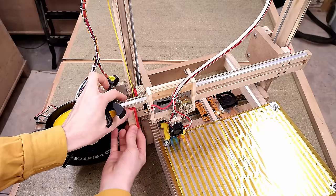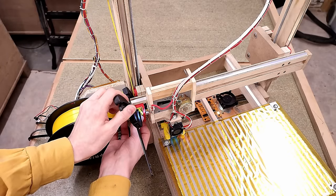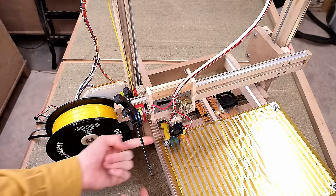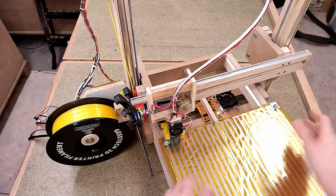Shit. I guess there may have been a reason I didn't put the fan there originally. Whatever, for testing now, I'm just gonna work around it by clamping a piece of wood to the axis to trigger the end stop a bit sooner and shift the homing position. It'll offset the print by about 2 inches, but on a bed this size, who cares?